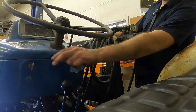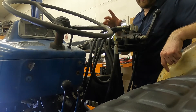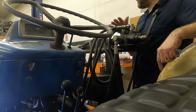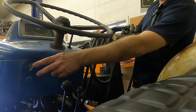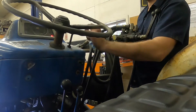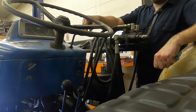I'm going to fire this thing up — it's cold, it hasn't been run, so it might crank for a second. I should not need to bleed this hydraulic pump because we have not disturbed the suction side. The pressure side is totally dry, so it's probably going to take a little while to work the air out of this system, but it should fire up. Within a few seconds I should be able to run the loader and the three-point.